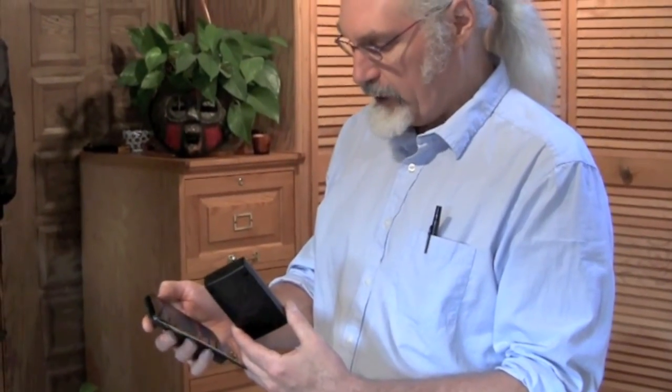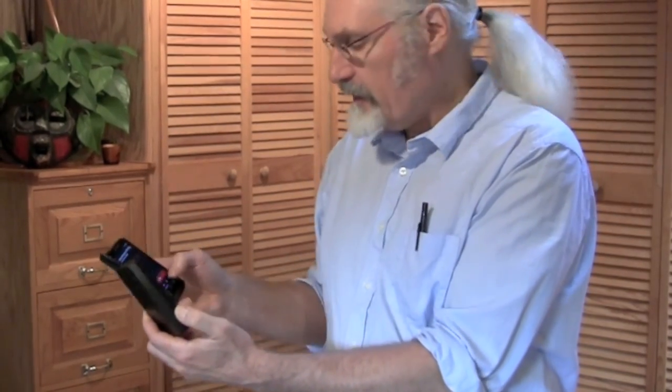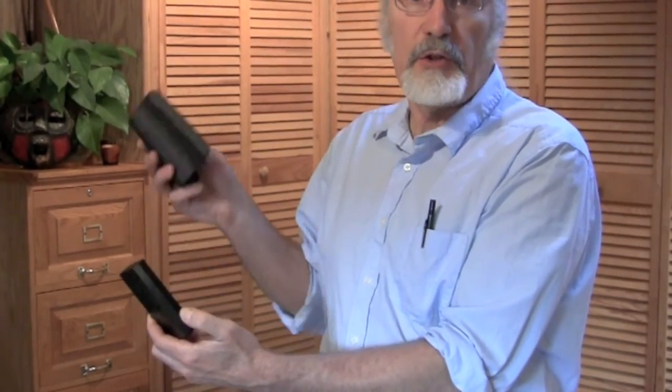And here I see a cell phone. Somebody just put a cell phone there next to the chair. As I take the source away, it's less. You can hear the sound is lower; as I bring the source up, it gets stronger. Pretty obvious. Indeed, the phone is on. Now I want to verify that it's this phone, so I want to turn the phone off. A lot of times the way that you'll figure out a source is when you find it, you'll unplug it or turn it off. And then all of a sudden that distinctive sound we're hearing will just go away — that's it. Then you turn it back on and it comes back. You found the source.